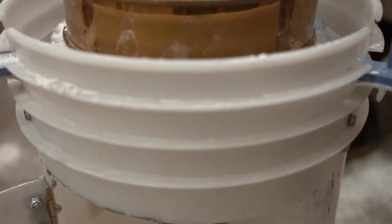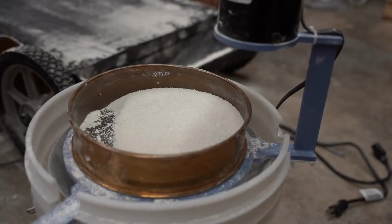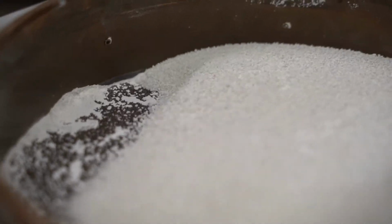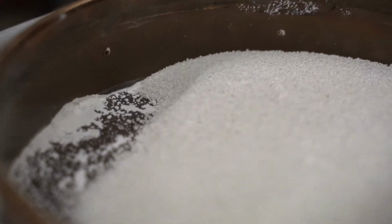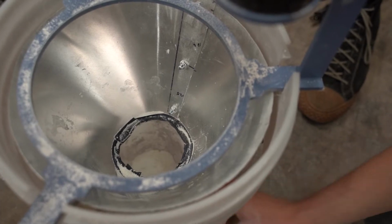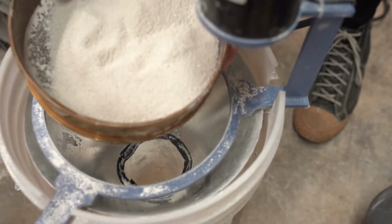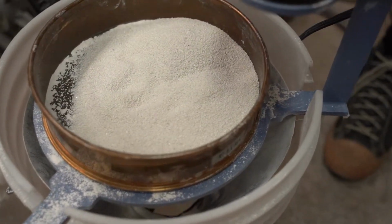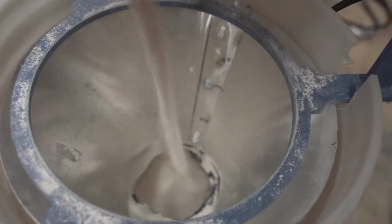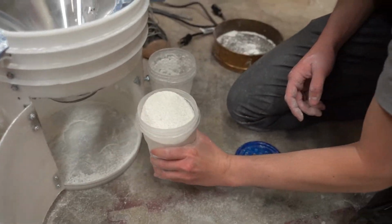While researching soil filtration systems, a pre-built sieve vibrator was found and purchased from Gilson Company, a soil separation specialist. This pre-made vibrating mechanism was mounted to a 5-gallon bucket, and a funnel was fabricated to channel the filtered strong layer into a container to be dispersed again. The weak layer can then be sent down the same funnel into its container. The containers are magnetically centered and attached to the bucket. This filtering system can separate material within 15 minutes under ideal conditions.